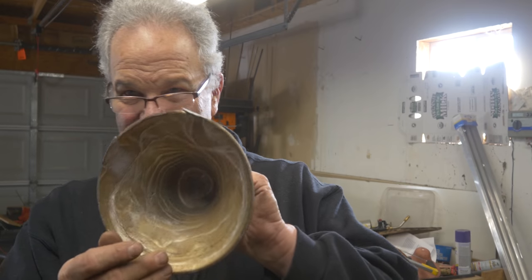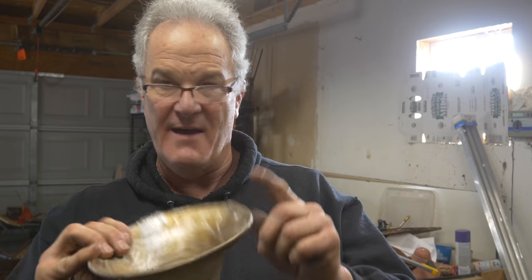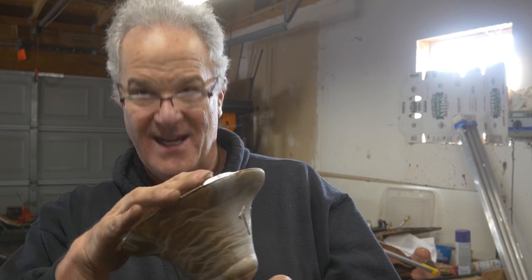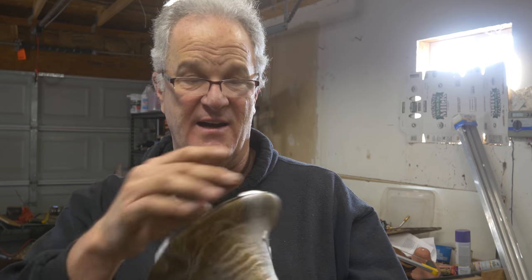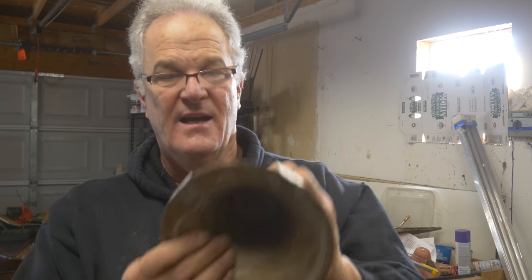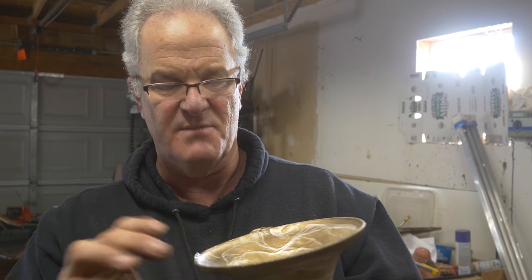I did cut off the gates coming in, and I wanted to show you this — this is why I brought it in from the rim of the bell. That's all I did: I just took a hacksaw and chopped them off those two guys right there. And you can see how much clean up I've got now — hardly any. It was a great place to come in. If I had come in from the side, I would be grinding all that down to the contour of the bell. This is going to be just a flat grind, smooth, done.